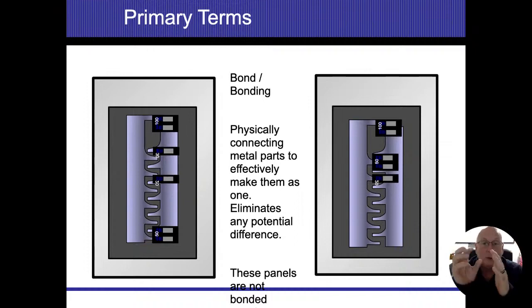If that dryer has a ground plug, a three-prong plug, that ground plug is going to be energized. So we energize the case, and the ground plug or prong is connected to the case, so that's energized. That's going to be energized to the junction box, to all of my conduits, all my plumbing pipes. All those items are connected together.